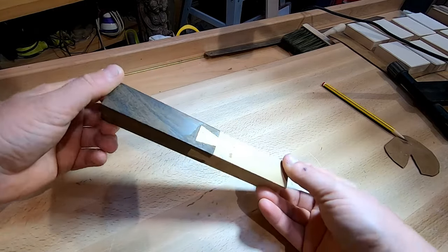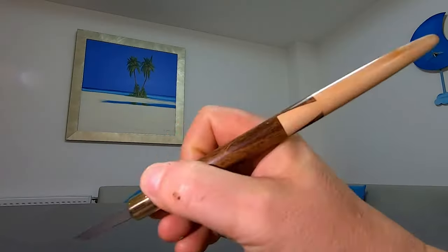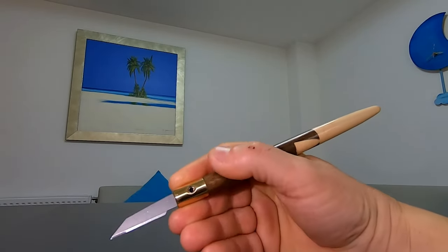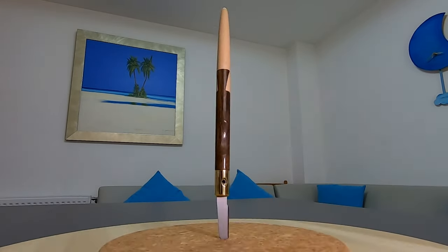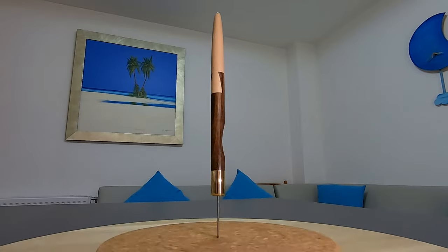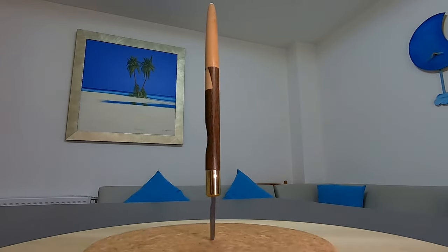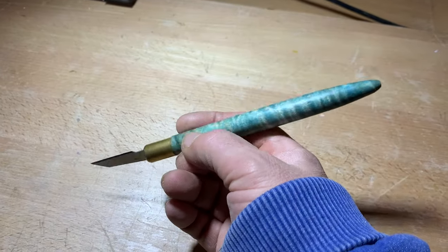This is how my first Mathesley knife started out — as an impossible dovetail that I glued together. I then turned it and out of it came this knife. It looked great and I really liked it, but essentially what I'd done was glue two pieces of wood end grain to end grain, and the dovetails just made it even more fragile, and inevitably it broke.